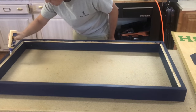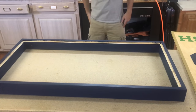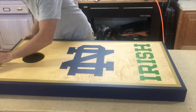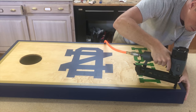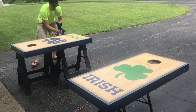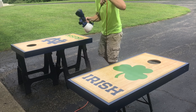With the frame and panel painted, I spread a good bead of glue along the rabbet inside the frame, then sank brad nails all along the panel. Since I'm nailing into this gold strip, I could easily fill the holes and touch up the paint for a flawless top. Next, I took the boards outside and gave it three coats of polycrylic. Using the SuperFinish MAX sprayer from HomeRight made this so much easier and faster, and it turned out really nice and smooth.